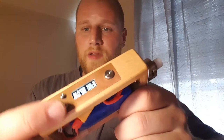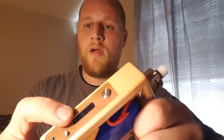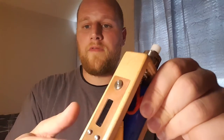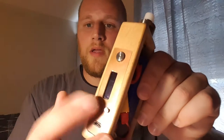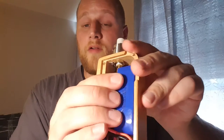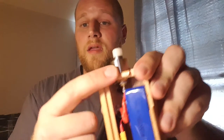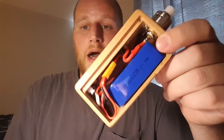Quick run-through of the parts: the buttons are from a Vamo V3 I ripped apart. The box maker on that Facebook group made this copper face plate, and there's also a carbon fiber one that goes on here. The board is from Evolv's website, and this 900 milliamp-hour battery is also from Evolv's website. Then the 510 connector — Fat Daddy 510 or the Varitube version, whatever you want to use. Not a whole lot of parts, pretty simple.